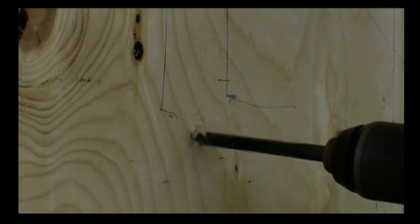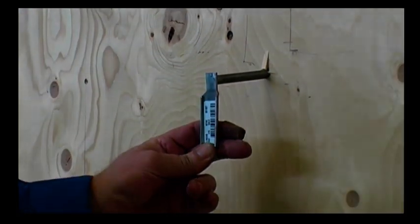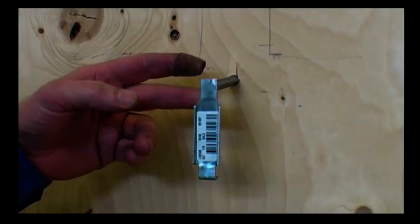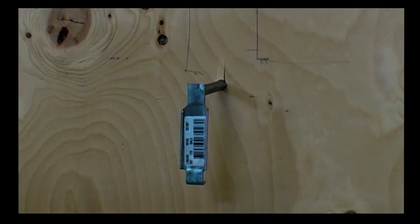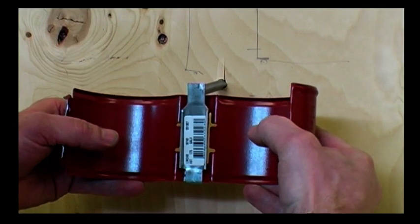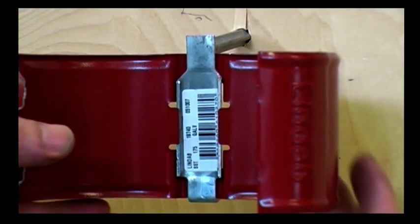Yet another example of a pipe holder is the SSV, the spike holder as it's also called. First, drill a hole in the facade, then hammer in the spike and mount the pipe holder for the spike. When the nail is in place, you need to ensure there's a small incline downwards in order for the water to run away from the house instead of towards it. You then slide the tin plate in place, first the bottom end, and then you pull in the top and fold it so that it locks around the nail.